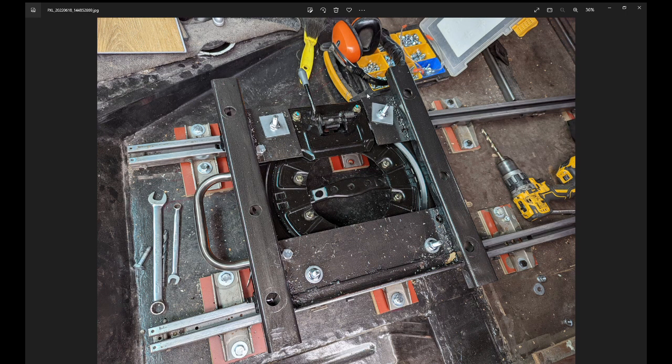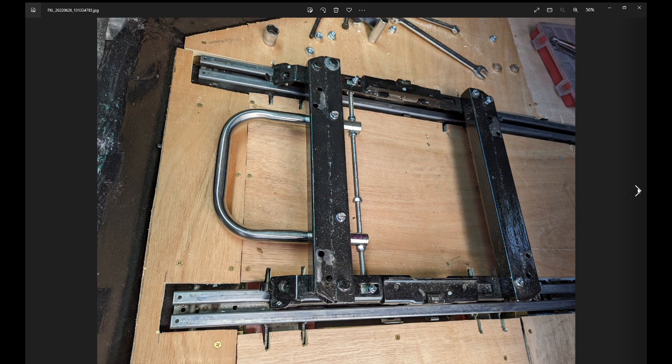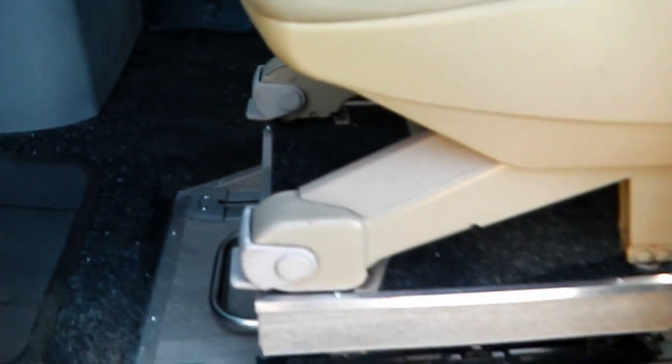On top of that I've made a frame welded up from the original steel box section and bolted that onto the swivel. Then I'm putting the floor back in - raised the floor back up 30 millimeters and started to put a new plywood floor down. There are little nicks in it just to make sure everything sits level. It's quite a framework under here so make sure you do it strong and level. You can see the mechanism there - it's a simple bar that pulls down two levers which release the locking mechanism on each runner.